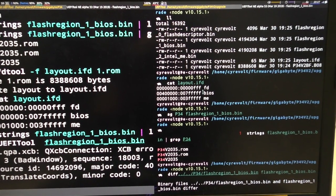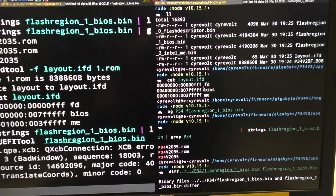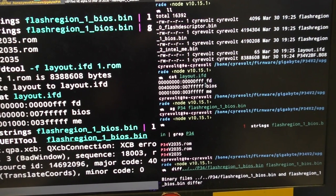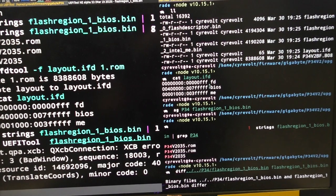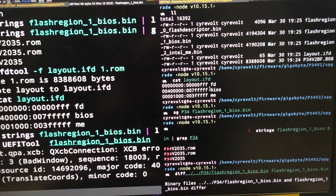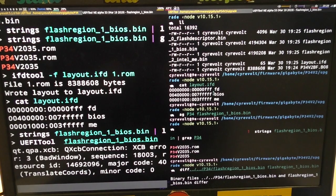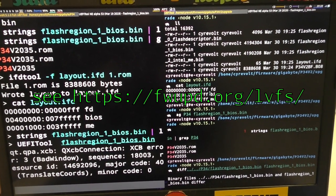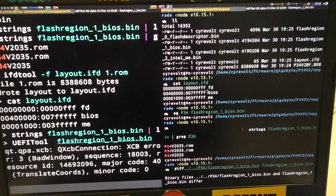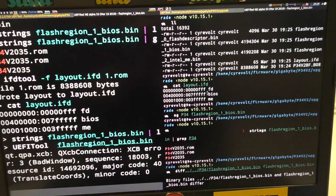And if you're asking yourself why I'm actually going through this procedure, let me tell you that the vendor thought that they should only provide upgrades for people who use a Windows operating system, leaving out anyone else using a BSD or something like GNU with a Linux kernel. So now I'm just going to do this in straight hardware. There's another tool named fwupd, the firmware update tool, which relies on a platform where vendors can also upload their BIOS images. But since Gigabyte doesn't do that, I will have to do this myself now.